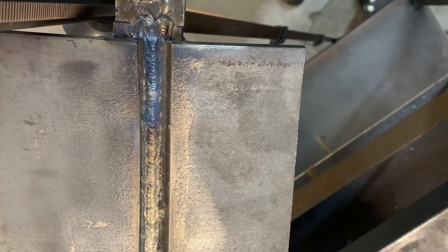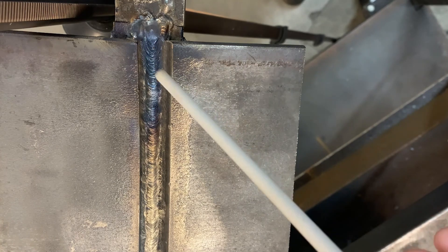I'm also switching directions — I was welding from this side in, now I'm going to come from the inside out, hoping that will correct the arc blow. I'm lighting up on my run-off tab first and then coming into the weld. We're going to travel a little bit slower, so get comfortable — this is a bit of a longer weld. We need to marry all those passes together with the backing bar. Because we're in the overhead position, we're susceptible to increasing arc length as your arm drops, so keep a nice tight arc length, keep driving that rod up into the plate. The weld metal wants to stay up into the heat. Watch the toes of the weld, then use the run-off tab and break the arc.